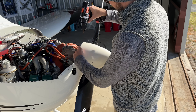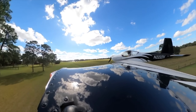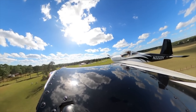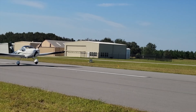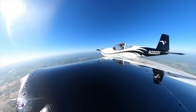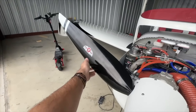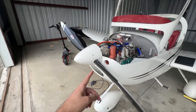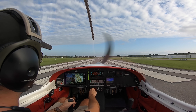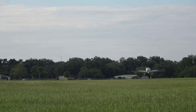With a fixed pitch propeller, you have to spend time on the ground adjusting the prop's pitch to get the best takeoff power and the best top-end cruise. But since you can't change the blade's pitch angle in flight, you lose power either on takeoff or in cruise. Ideally you want a high RPM on takeoff so you get the most power, don't use a bunch of runway, and can climb really well. But your top-end cruise is going to suffer. That's something I kind of fought with my old two-bladed Sensenich propeller — it gave me a good top-end cruise, but was kind of hard on the engine on takeoff. I'd get about 4,900-5,000 RPM on takeoff, so I wasn't getting the full 100 horsepower out of the Rotax.